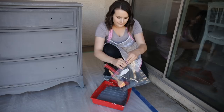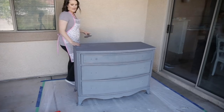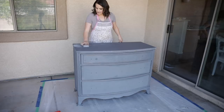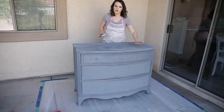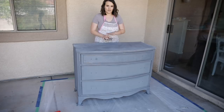Here is how the top is looking after the first coat — you can see some of that previously painted color is seeping through, but that's okay because we will take care of that in the next few steps. Now that the first coat has dried, I'm going to very lightly sand over the entire surface of the dresser using a medium-grit foam sanding block. This is going to ensure a very buttery smooth finish when you're completely finished painting and will make your top coat go on so much smoother. Note: this is not to distress the piece, just to smooth it out.